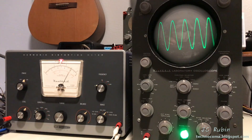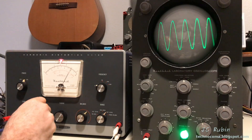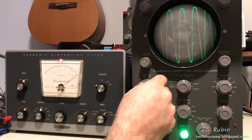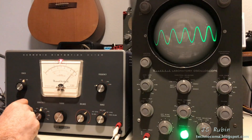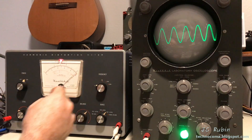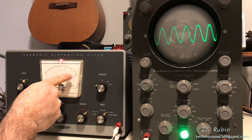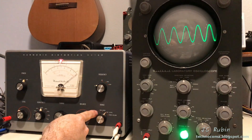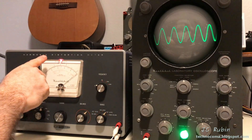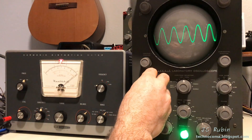This is the point where we bring it all together. We're going to be testing this single frequency at this single power level on the harmonic distortion meter, the Heathkit IM12. I'm going to take it out of the voltmeter setting — and we can see it went way off the rails. The reason is we have to turn down for the set level, because we were overdriving the front end on this meter. What we want to do is make sure that the set level sits at 100%. This range knob needs to be on one of the two set level locations — and now our meter is sitting perfectly at 100%.